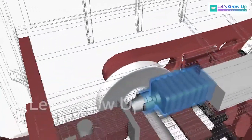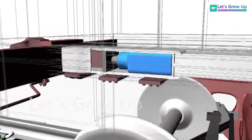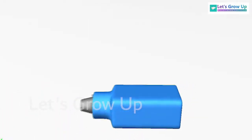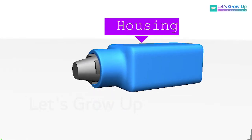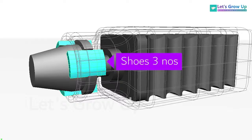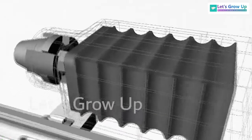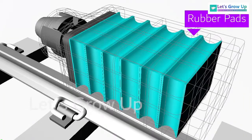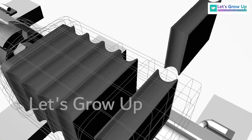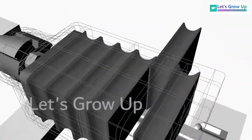The draft gear is tightly fitted in the yoke with a front follower plate. Let's see the different components of RF-361 draft gear: housing or cylinder, wedge, shoes, top follower, rubber pads, elastomer unit, etc. Each RF pad has an ultra-high-capacity natural rubber spring package to absorb the high longitudinal forces arising due to operations like acceleration and braking, and also due to changes in track topography.